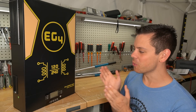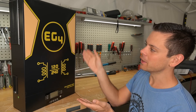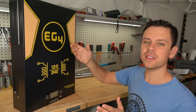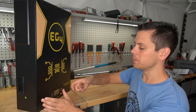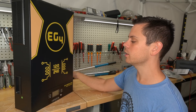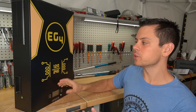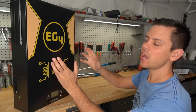This is similar to the LVX 6048 by MPP Solar, but EG4 made their own and added some new features. They increased the PV input capacity from 6,000 to 7,500 watts and increased the input voltage. The battery terminals are larger and you can now put conduit on the bottom — I complained about both of those things in my LVX review, so I'm glad they fixed it. They also have new firmware coming out with more features, and communication protocols with EG4 batteries. Overall, it's a slightly upgraded LVX.